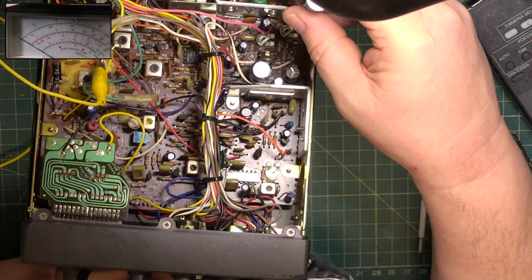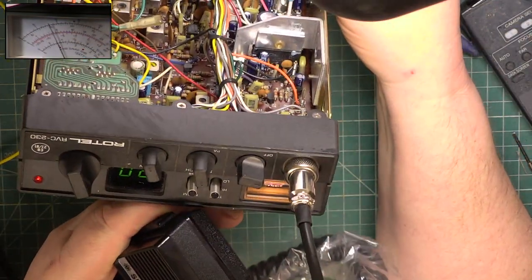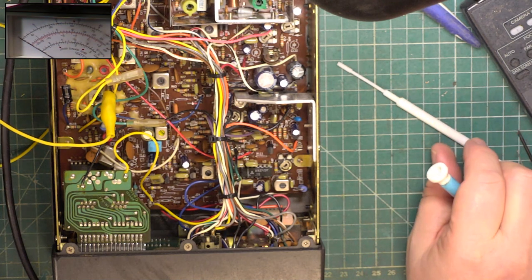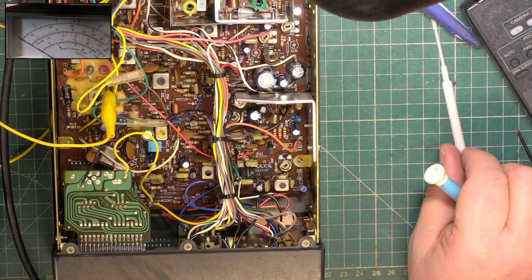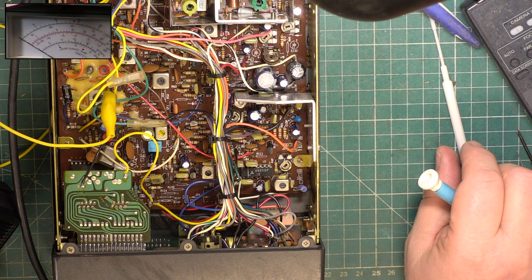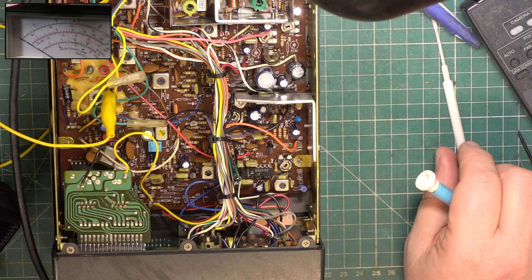I can hardly see the meters on these. So, we had a Motorola business two-way radio system, some second-hand radios. There was a CD100s. I forget what the base station was. But anyway, we had selective calling. This was FM VHF high band. So we're talking about 17 something transmit, 16 something receive. Business radio in the UK has a 4.8 meg split between, you can't talk vehicle to vehicle, you have to go through the base.